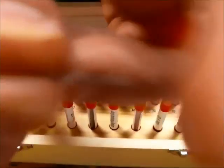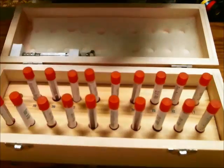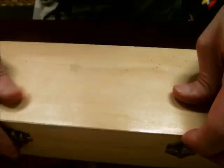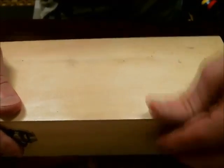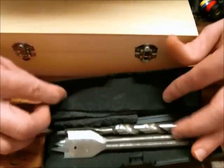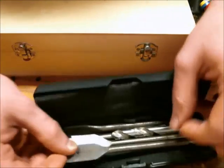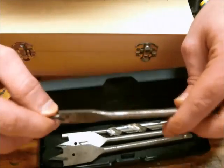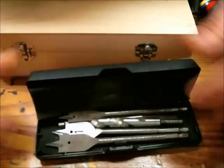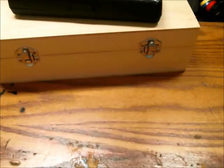The smallest one is extremely small — maybe you can see that, maybe you can't. You also may need to drill larger holes, so you would get something like a step drill bit set. Here's the one inch, then the three quarters, one half, and so on. It's good to have large, medium, and small bits for your enclosure designs.